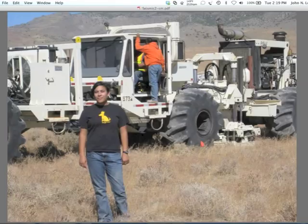Seismic acquisition involves putting out active sources of seismic energy and then recording them with sensors called geophones, and linking those geophones back into some kind of recording system. Occasionally, and more and more often these days, each sensor will have a recording system integrated into it. But the data still have to be broadcast to a common archiving site.